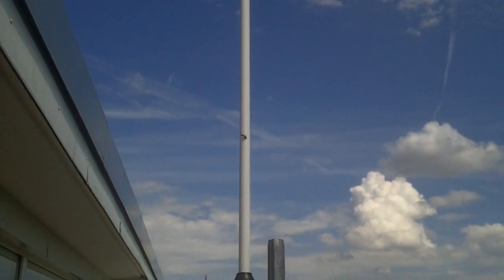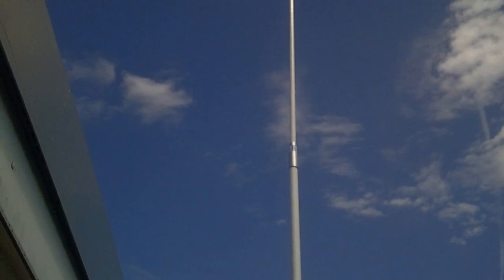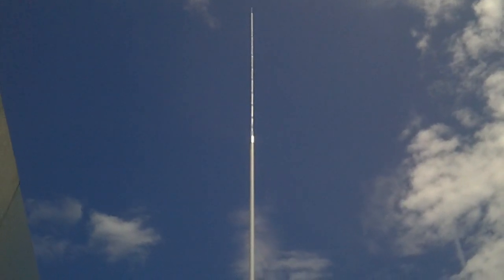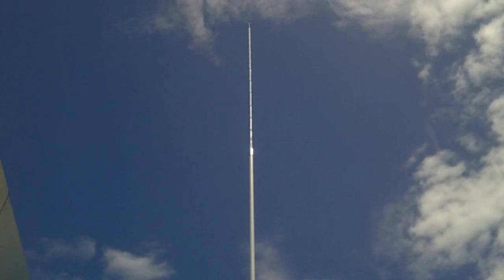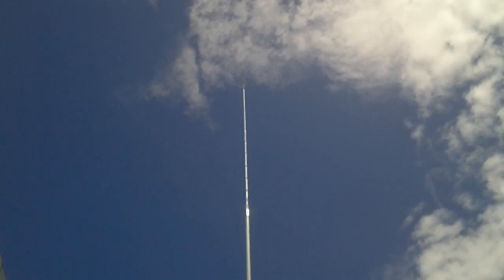Currently set for 13 centimeters in width and length. The lowest usable frequency is 26.515 MHz at 1.8 SWR, tuning to 1.4 by 27.025, and from 27.415 to 27.555 MHz.